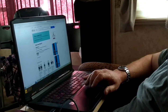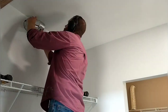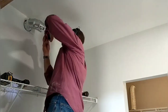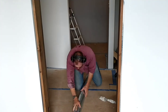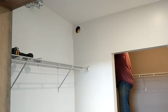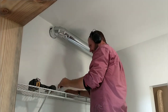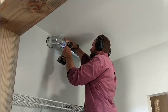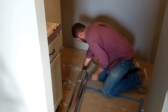Another part of the build that you don't really think about is all the time spent ordering stuff — I spend hours researching materials and products and ordering them online. I'm finally getting back to the dryer vent installation. I had originally run it with a flexible pipe, but some wise viewers advised us to go with solid pipe because flexible pipes can collect lint and be a fire hazard. So we're changing that out and installing solid pipe. I'm running it exposed on the interior — it goes with the industrial theme we have going on and I kind of like the look. We've purposefully avoided running anything through the ceiling to minimize possible leaks and make it more maintenance-free.